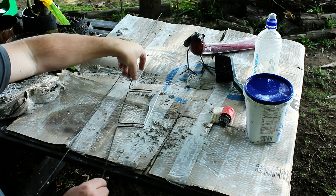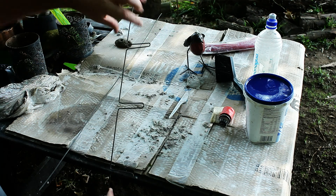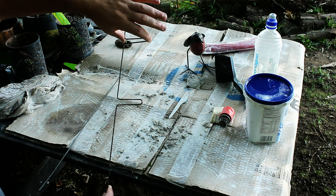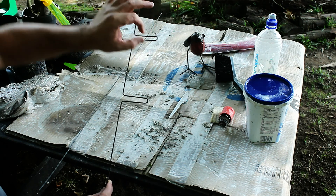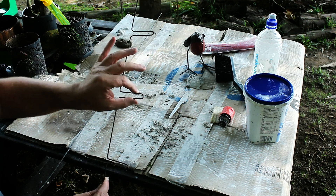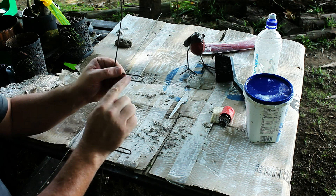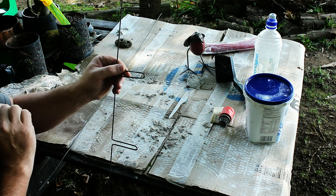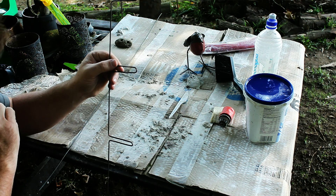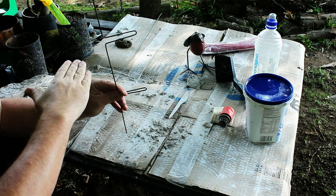Basically these are 138mm half-waves and these are 67mm quarter-wave matching stubs. They are 4mm spaced there and then 1cm spaced in the centre. I'm going to clean this off here and solder it on and compare and contrast results.